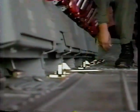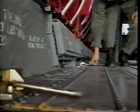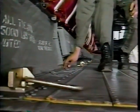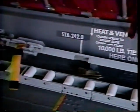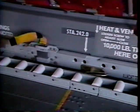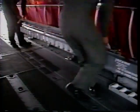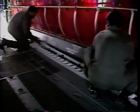To begin installation of the rail and roller assemblies, angle each such that the rail bumper is clear of or just touching the buffer board. Rotate each rail to vertical. Some fore and aft movement may be necessary if interference occurs. If a floor patch causes interference problems, you will need to modify and repaint the interference area according to HICS technical manual specifications.